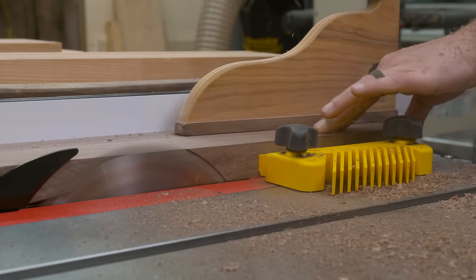Finally it was time to flip everything over and drop on the tops — like a glove. I used my initial dog hole as a guide to drill into the top of the tenon and plunge all the way through until reaching the bottom of the portal, then squared it off a bit more for better access. From there I used my brad point bit to locate the center point for the pilot hole, flipped the base over, and drove in the mounting screws — with plenty of wax on the threads since these screws are massive. With my two top slabs attached, it was time to get them flat. I clamped two jointed sacrificial boards onto either side, attached string in an X pattern across the bench, and tested for flatness. I then built a quick sled to ride on top of those rails for the router, and started passing a massive flattening bit across the top of the slabs — kind of like a human CNC machine. Since the bit is so large there's no dust collection, so definitely wear a mask.